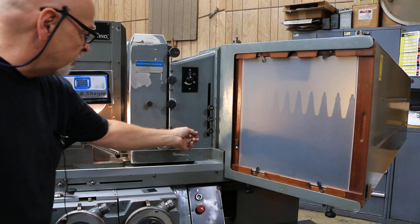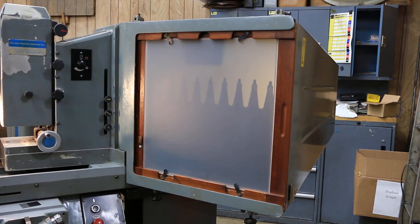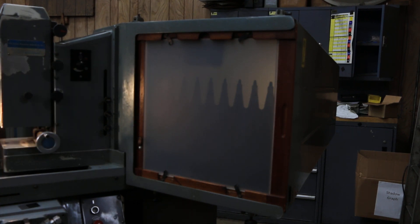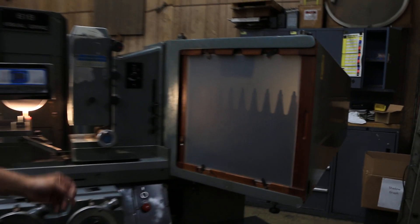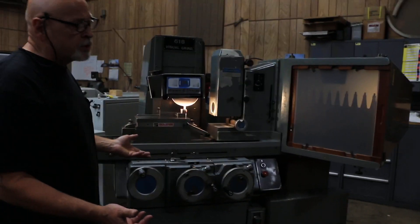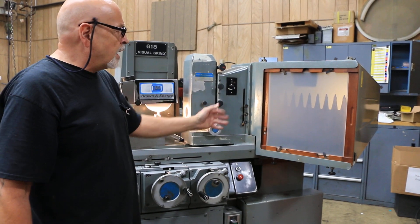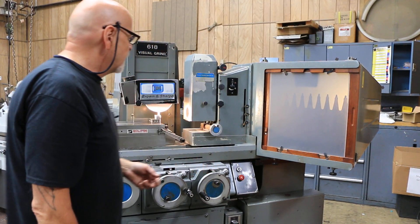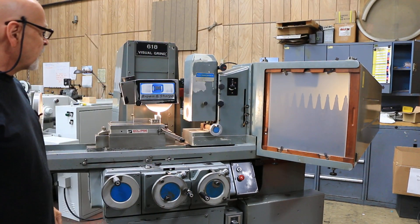You can adjust your view here — there are adjustments to move your image up and down and across, very fine adjustments. You have a light intensity control; you can lower that or turn it up brighter. The arrangement right now is a frosted screen found in the cabinet that's probably the original one, maybe never used because it's in really great shape. They did have a clear glass on there where they probably had an overlay. You would also use this machine with an overlay for the part you were going to grind, and depending on the lens and magnification, you'd have the right graphics silkscreened on that glass. There are also chart rings available where you can have a slide-in mechanism and a round screen with a protractor so you can measure degrees and angles. It's a pretty versatile machine.